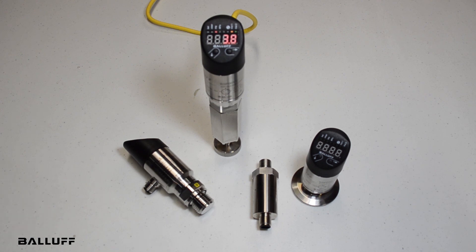Some additional enhancements made to the sensor: we now display the sensor operating hours, and there is a pressure peak counter — whenever a peak occurs, both positive or negative, it's detected and the sensor keeps track of the number of those. We also monitor temperature. The sensor is also able to work in SIO mode, so if there's no master on the IO-Link, the sensor assumes it's a standard input-output type sensor.